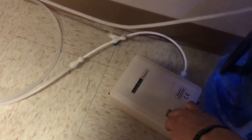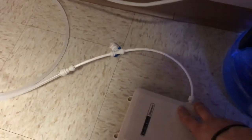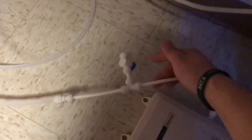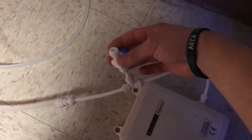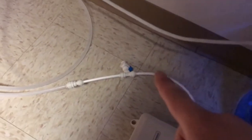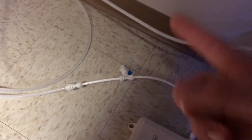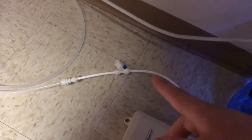When you first turn it on there's probably air in the line. What I found to fix that is just to add a T and a shutoff valve, so that way I can open it, purge all the air out, and then close it. That way it'll just have water in it.